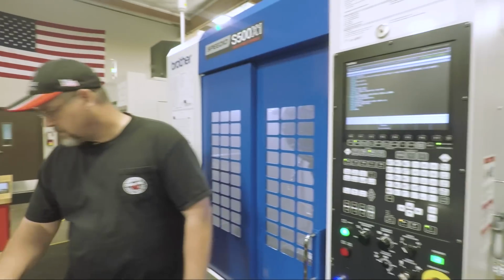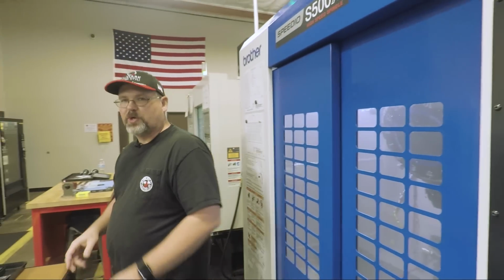I would have to look it up. It's like 67, 68. And same thing, you grind into it? I guess grinding. I have not done it. You can hard mill, I know, 60, 65 Rockwell with carbide, with coating. Right. And grinding is way better, easier. Yeah, still insane. We do some hard chrome steel. Essentially ball bearings that we put holes in. And we buy some special tools from OSG. Yeah, I take really small cuts. Insane. It's really cool. Let me go grab some of these diamond tools to show you.